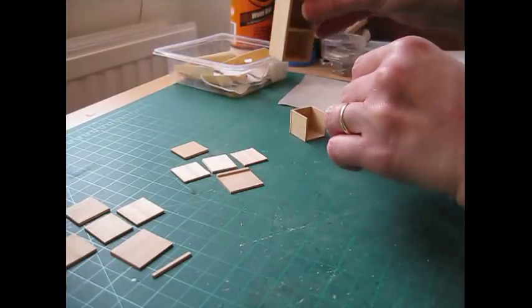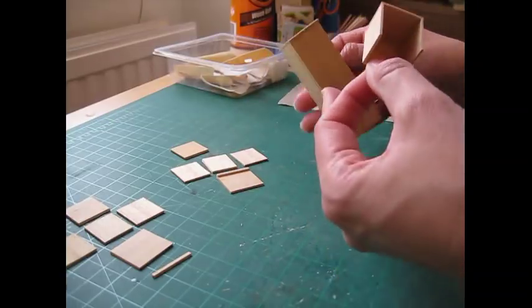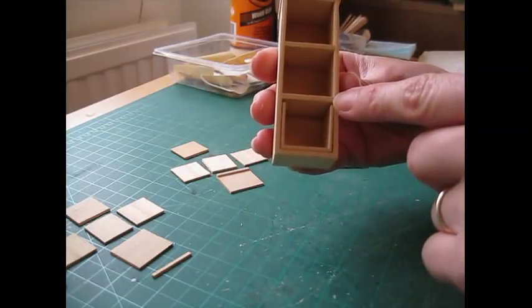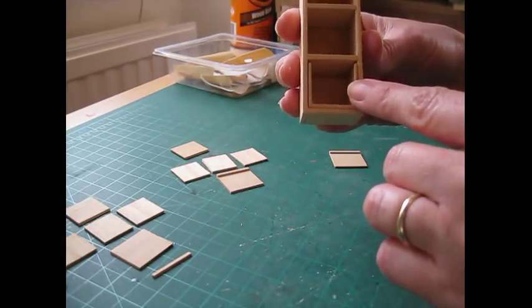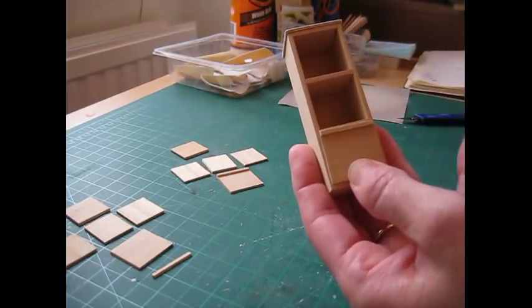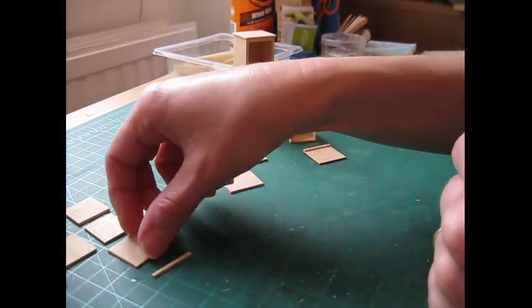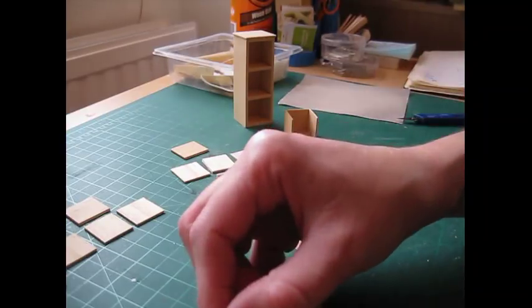It's not quite as important that you get the fit of the drawer exactly right. So I've actually given sizes for the pieces so that it just fits nicely inside, and you'll see it doesn't come to the top of the drawer, sits flush to the front, and it's a little bit narrower than it needs to be as well. And that's because once the front is attached, the front sort of holds the drawer in place and will hide any gaps around the edges. So that's why I didn't say that this time, and the drawers are just constructed slightly differently, in that we're going to start by attaching the handle along that top front edge.